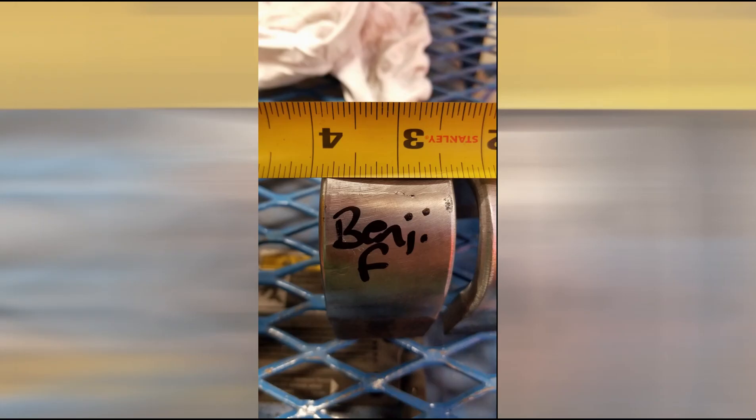In this case, we have a minor defect — actually a couple of separate defects. None of them are larger than one-eighth of an inch, and the total length does not exceed one-quarter inch. So this would pass.